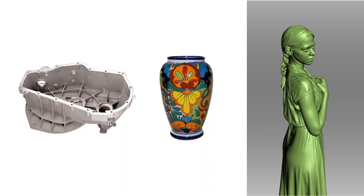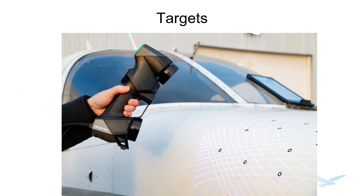Just because target tracking isn't integrated into a company's core technology doesn't mean it's not an option. Artec, for instance, is a brand that focuses on targetless geometry and color tracking — they're known as the champions of that technology — but they've gone to the trouble of making their scanners compatible with target-based photogrammetry kits from third parties, so users have a choice to use targets in situations where they bring something to the table. Just because a brand focuses on the convenience of targetless tracking, don't assume targets aren't an option. As for brands that incorporate targets at the ground level, Creaform is the quintessential example — and that takes us to the third method of tracking, which is obviously with targets. Creaform's most popular scanners from the HandyScan line use target recognition to map the collected data together.